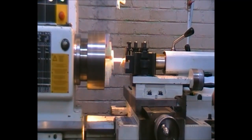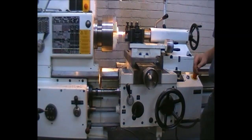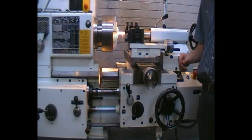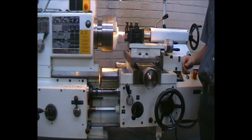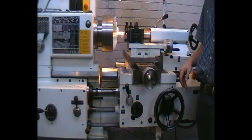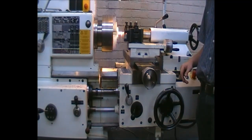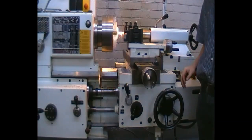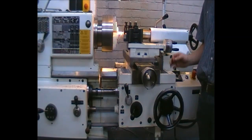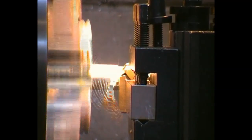Because we are taking a very shallow cut, in this instance it is not necessary to use coolant. Certain materials and certain depths of cut do not need coolant, but if unsure, rather use coolant or ask the instructor. Visually, we can start seeing the surface finish which is very clean, very smooth, and 100% round, as the extruded material which you normally purchase at the shop is not perfectly round.